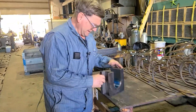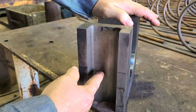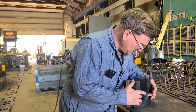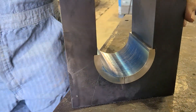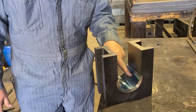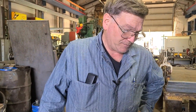When they pinned these original bearings, they put straight copper plugs through here and then swaged them out. That seemed like quite a bit of bother to me. I happened to find some brass tapered pins — you don't normally find them in brass, but I found some that were big enough to do a decent job on this. I'll put them in from the inside so that they can't fall out, and then we'll just grind the ends off a little bit.